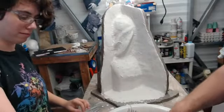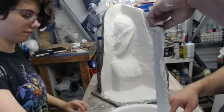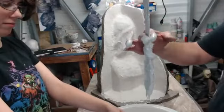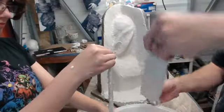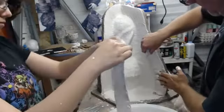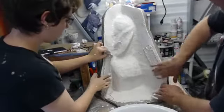Yeah. So we're moving on with burlap. We're just going to let it sit as long as we can, probably work on the mold walls. But basically, if you can see this, this is our burlap soaked in the Hydrocal. We're going to take off most of it, kind of squeegee it between our fingers, very lightly, but it's still very wet. And we're probably going to start working on building up a little bit around the mold wall first. So we're about a quarter of an inch in from the edge of that mold wall.